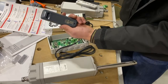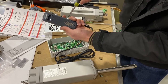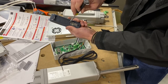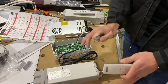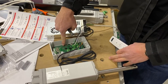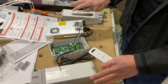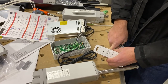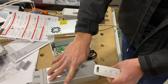To finish programming the first motor, press the program button on the back of the remote. This tells the motor: I'm done programming — the unit is exactly the way I want it. You'll see the flashing program indicator for motor S1 turn off, confirming it is no longer in programming mode and motor one is set exactly the way you wanted.